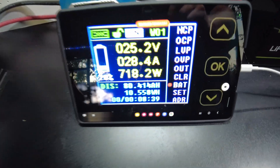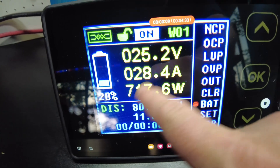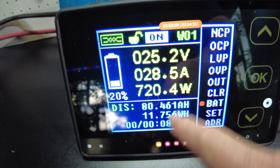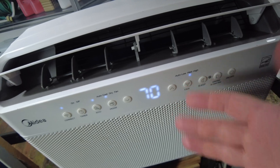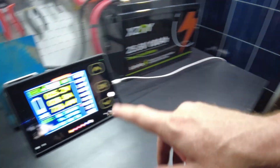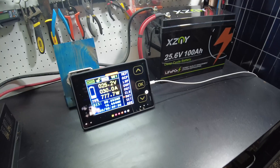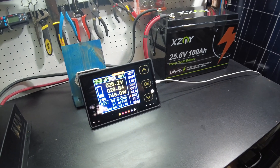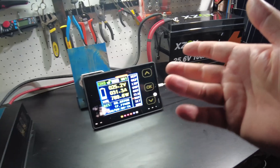The compressor came back on the air conditioner, so we're climbing back up doing 28 amps right now. I went ahead and set it back to medium. I don't know why going from medium to low and pulling less power would cause the BMS to shut off. I'm going to let this continue and I'll be back when it either completes or shuts down again.